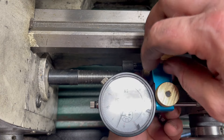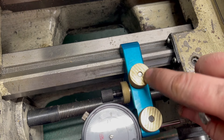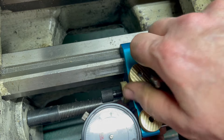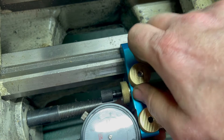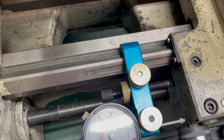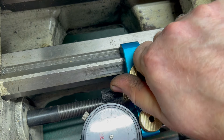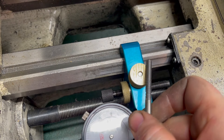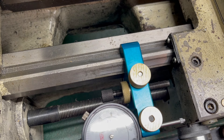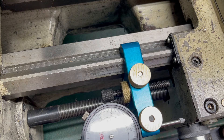I didn't want to have to loosen it completely until it was open enough to pry this off. One thing I might change — but don't want to film yet — is adding a couple of little threaded knobs. There's the kinetic coefficient of friction and the static coefficient of friction: it takes more force to get something moving than to keep it moving. When I tighten this it's already moving, so kinetic friction is going — but once it's stuck, it takes more force to remove it than it did to tighten it. So I might put two little knobs on there. I always have something that shape around. I could put a nut on and get a wrench, but then I have to find the wrench and it gets really messy. It's a lot easier just to stick something in here and give it a little crank to have it come off.